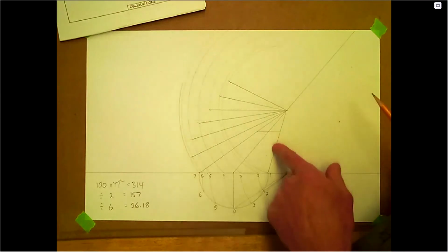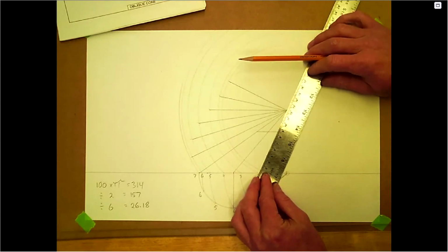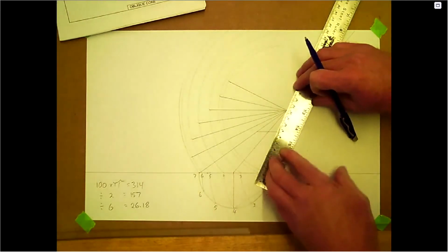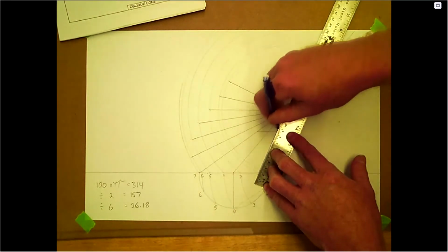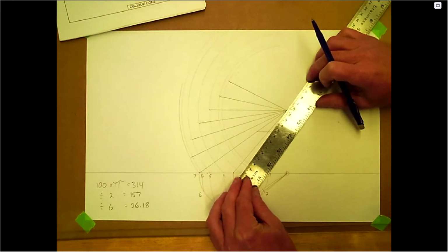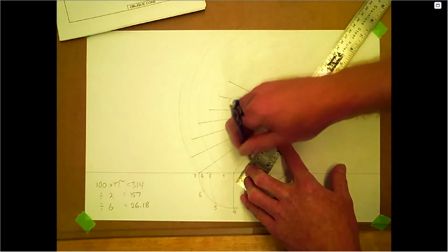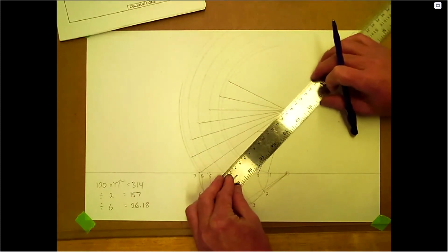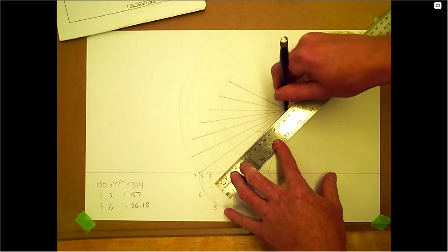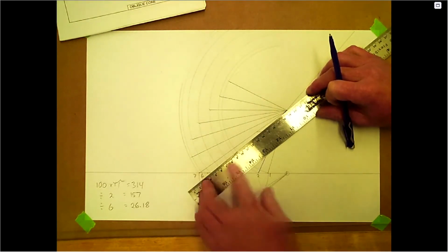Okay, so we do need our true lengths coming through this truncated part here. So let's go ahead. We're going to get a few lines on here, I know. Maybe I can use my blue pen for these true length lines. For 4, just because our center lines, it kind of looks like we got two center lines with 4. Just making sure we have a difference with those. 1 and 7 are still going to be the same true lengths.